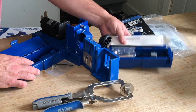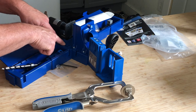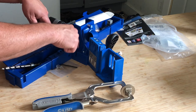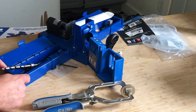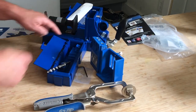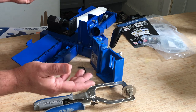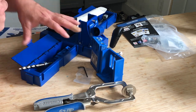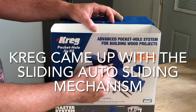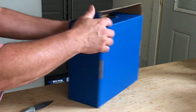I'm going to measure how big it is, find a piece of plywood long enough to set this system up on and attach it. In the video I say those are attachment holes — they're not. Those are for a depth stop for doing repetitive pocket hole procedures. The attachment fastener holes are actually on the sides of the cases. And this new cartridge system — the pocket hole cartridge actually travels up and down at an angle to match the thickness of the wood, so you don't have to figure anything out.